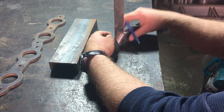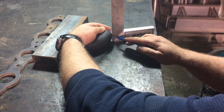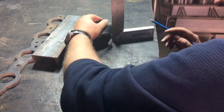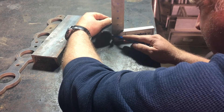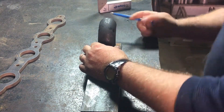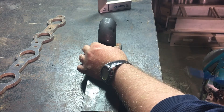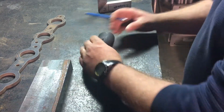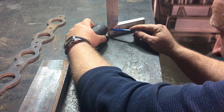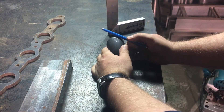I'm marking the center of this weld elbow — both the center of the outside and the center of the inside — and then I'm going to line it up with the line on the c-channel and tack it down. That way I can put it in the chop saw and make a cut, because it would be really hard to clamp this piece securely on the chop saw otherwise. I'm also going to mark the center of the outside, which will be the mark I line the chop saw blade up with.